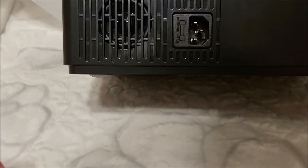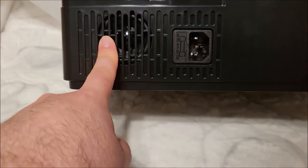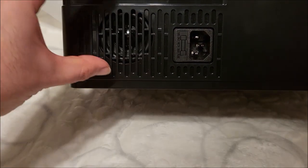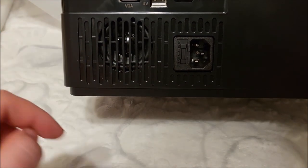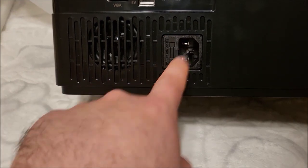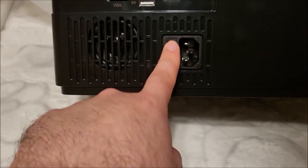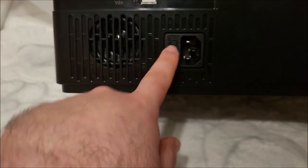And here's that speaker that I'm talking about, the internal one. It looks like maybe a 2-inch diameter speaker, one of those 6-watt ones. Not very large, decent mids and highs, but not so great bass. And interestingly enough, it looks like the AC input, which is the IEC connector obviously, has a fusible input, so you can actually pop this out if the fuse blows.